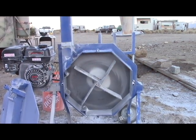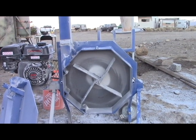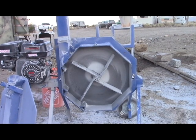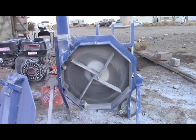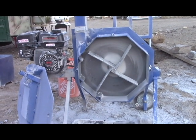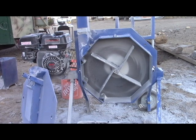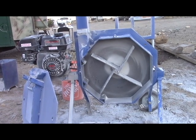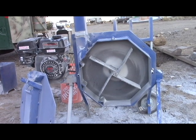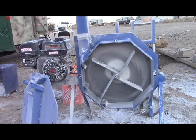This is what the impact mill looks like on the inside. The rotary impact assembly is simply a quarter-inch steel plate welded onto a shaft. Those three pieces of angle iron serve to both slow down the air flow and provide a secondary impact surface — kind of like hammering against an anvil instead of just smacking something in mid-air.